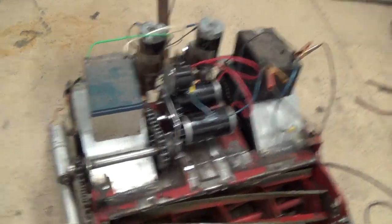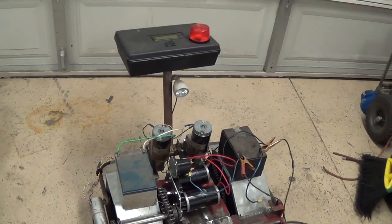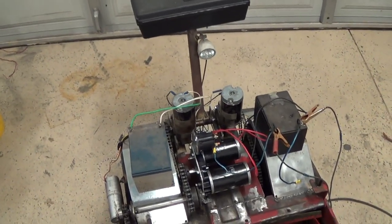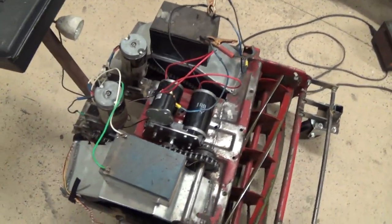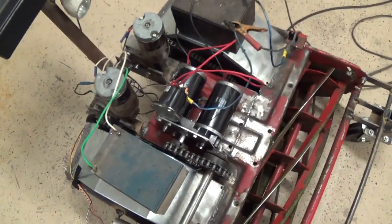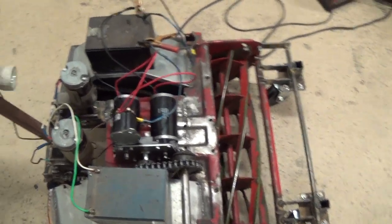So you notice that I'm still running this with a solenoid. I'm going to be changing that out to an electronic ESC. I also added batteries, sealed acid batteries. Now that this is an all 12 volt system, I will be looking at the drain, how much current these motors pull, to assess whether or not I'm going to keep a separate system or link them. But these motors seem to be a bit more efficient than the other ones, so we'll probably be linking the system.